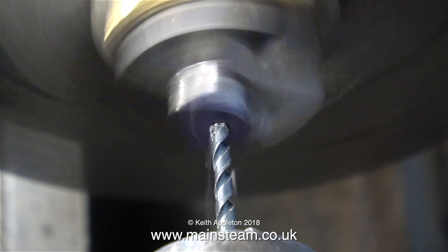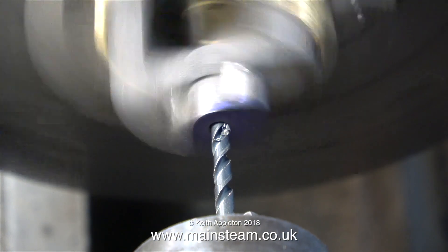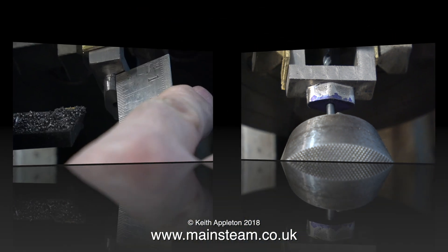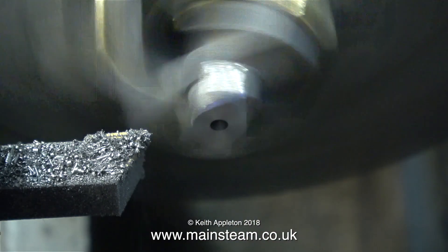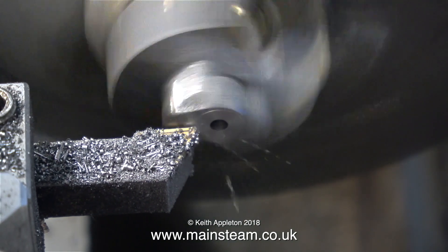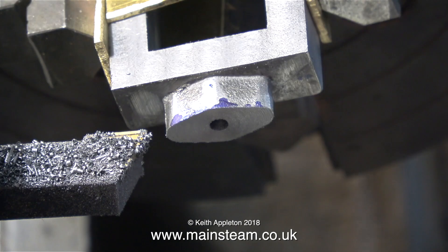This is a one-eighth of an inch diameter drill — you don't need to use a reamer, a drill will be fine for this job. You're supposed to drill a hole in the far end of the steam chest to support the valve rod. The hole in the other end is supposed to be smaller than one-eighth of an inch diameter, but I don't do that — whatever the diameter of the valve rod is, that is the size of hole I drill.